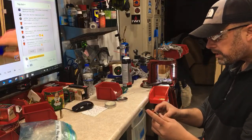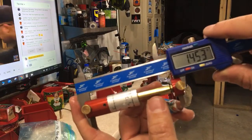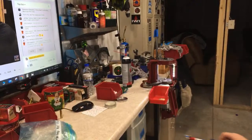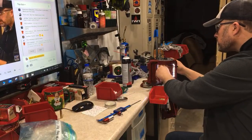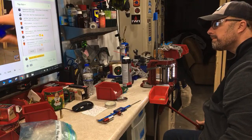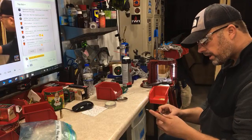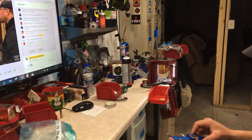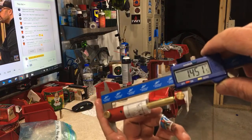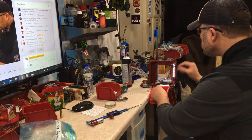So this piece, we already know it's 4.53 because we already resized it in the previous video. So 4.53, and we are gonna bump this to 4.51. It's all about consistently running the handle and your ram. And right there, my friends, 4.51. So let me lock this down.